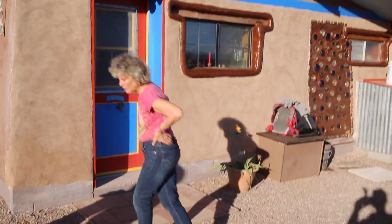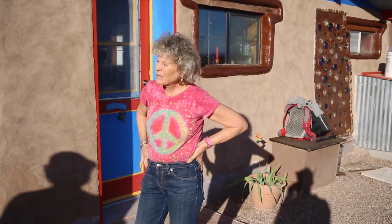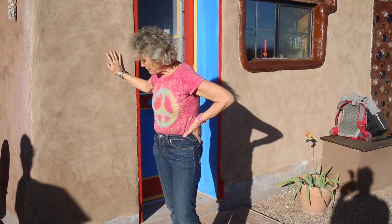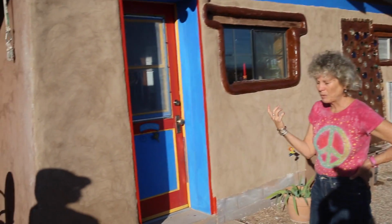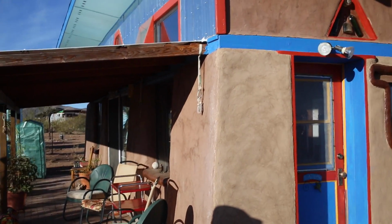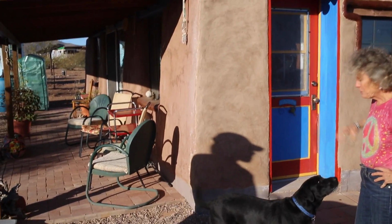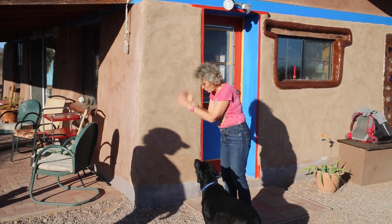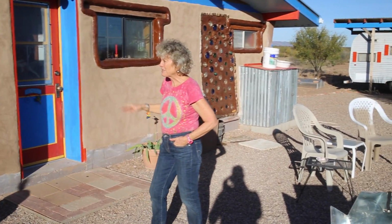And we're actually switching our plaster. We used a plaster that involved concrete, and this is going on year 5, and it was sufficient, but it wasn't perfect. This is a new plaster. It's lime plaster, and it's holding up much better, and it looks better, and it adheres better to the cob. So we're switching over wall by wall. The other plaster lifted, and you could just bang on it and big sheets would fall off.